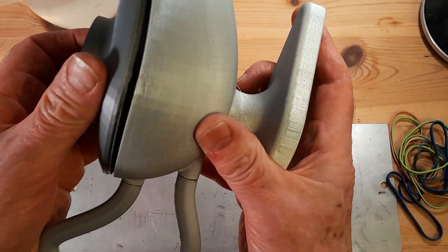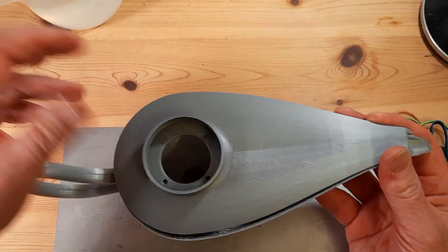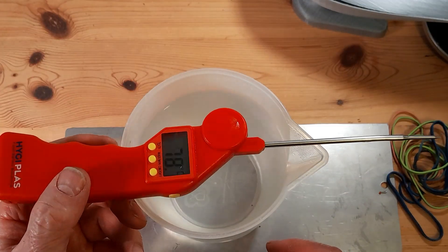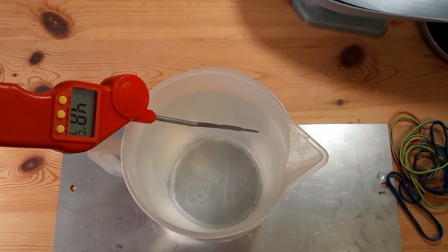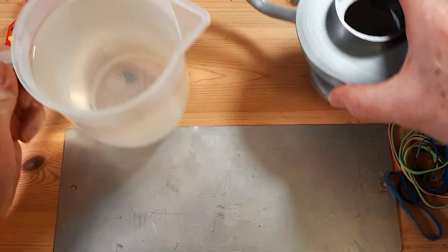So I have a good fit at the back but a bit of distortion at the front. I hadn't tried this before, so I decided that 80 degrees C would be a good temperature to soften up the PLA a little.